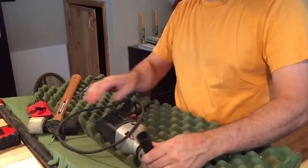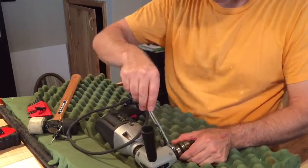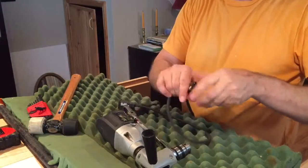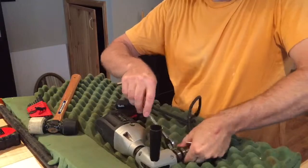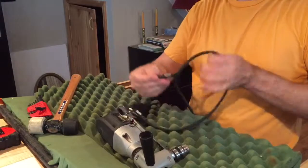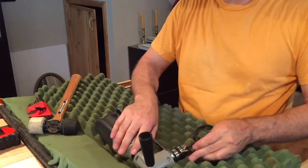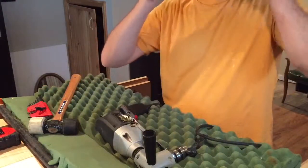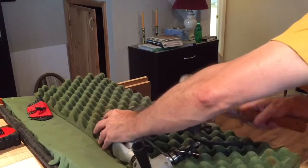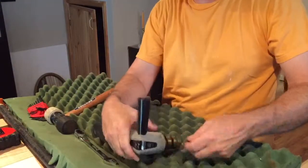So to do this — this is the chuck that actually belongs to the drill. I've got a half-inch nut there, which I'm gonna use to hold that nice and still. I'm gonna put this right into the bit. This is where it gets a little bit ugly. And I'm simply gonna use brute force to hopefully loosen that, so that I can unscrew it by hand.